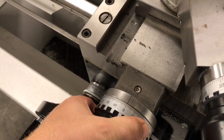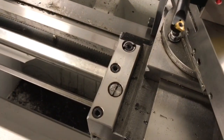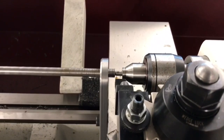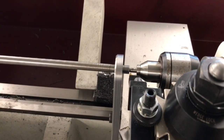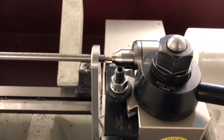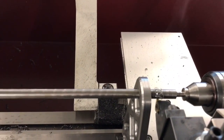So once I get this set up and dialed over, I want to engage my half nut and go about cutting the threads. In this case, before this setup, this would have been a nightmare to try to do. With the plate in place, it just goes and cuts like nobody's business — just cuts without any push-off, any flex, anything at all.